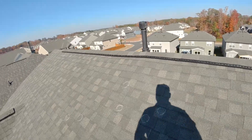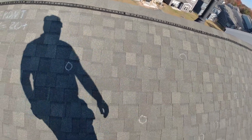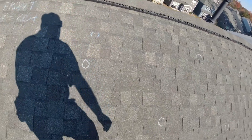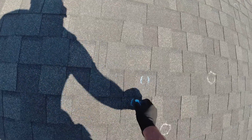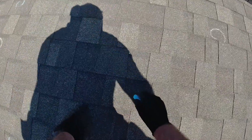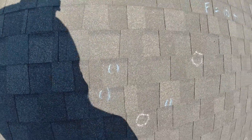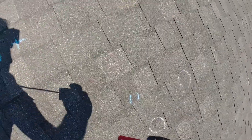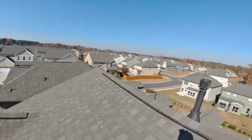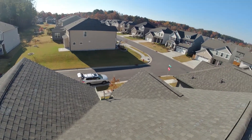Go over the front — this guy's got them all over the place. We've got a decent one there, got one there, got one there, got one there. Definitely got 10-plus on that as well. He's got marks there — I don't know that I'd call all of those hail hits, but I definitely got some good ones. After I've done the front, right, and left, I do some overviews: big overview there, overview there, one there, and one there. Go ahead and do the back so I don't forget it.